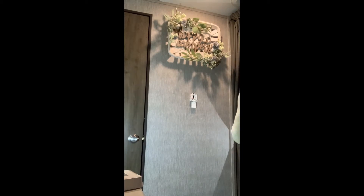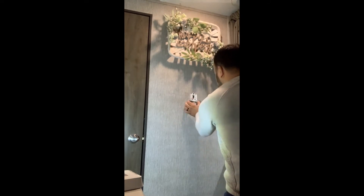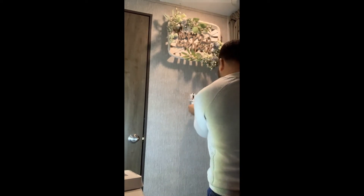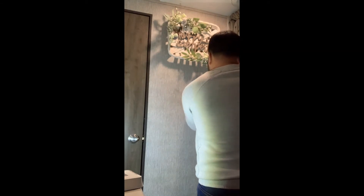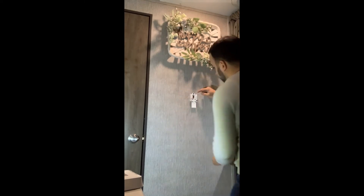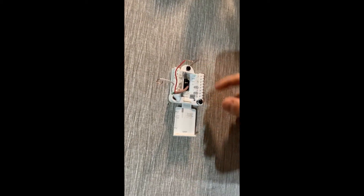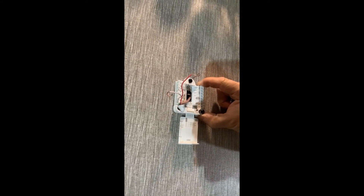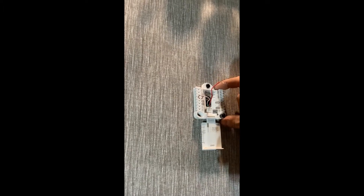The next one just like this one out there. If you guys can see that, I'll bring you guys closer to show you. Basically you just want to level it, get it straight. You can use a level, but since this wall is so small I'll judge by eye. Plus after you put the top screw and start threading the bottom screw in, you can basically adjust it if you need to level it out a little bit.